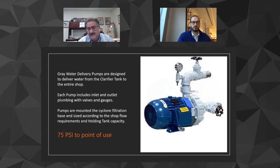Long story short, that nipple going straight down is enough water for that pump to dump. If I shut that big valve off on the top of that outlet, that pump would not burn itself out because I'm going to give it enough flow. We have to make it idiot-proof. I'm sorry. So that's what we try to do.